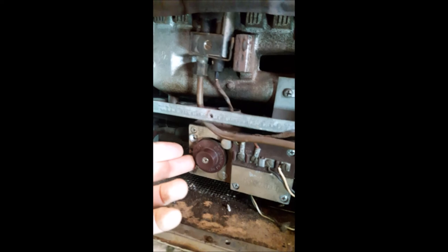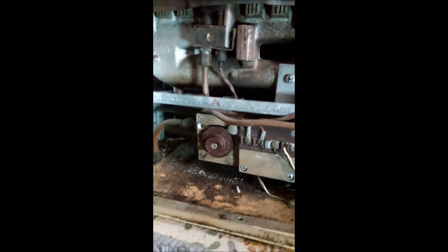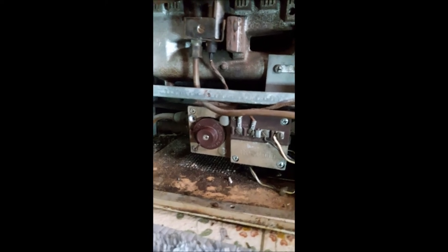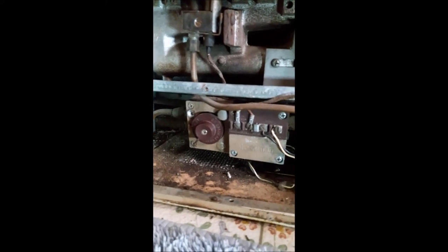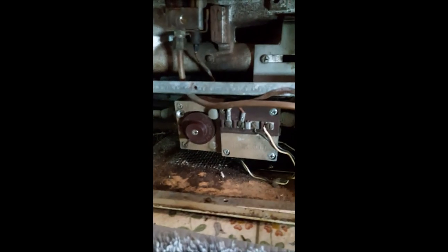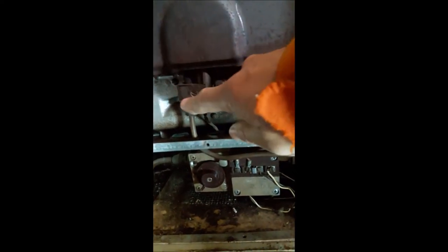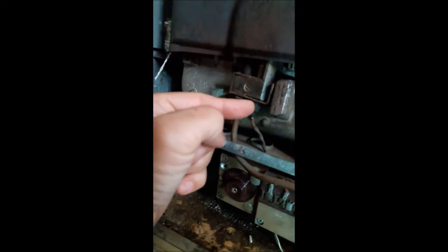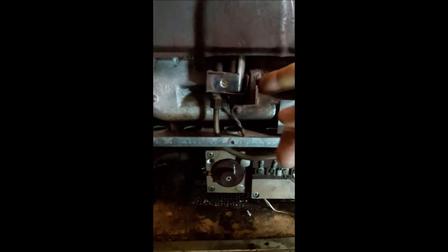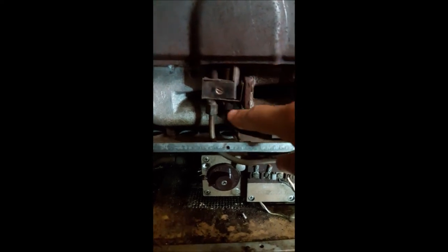This is the big moment. If I push it down I can hear the gas coming from the liquid propane tanks up front outside the trailer — and it does ignite. But it's going to be a problem because this connection is leaky. When I try to light it there are flames all around this whole thing. I'm going to have to disconnect this, maybe replace this part.